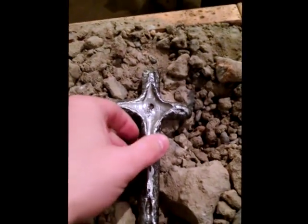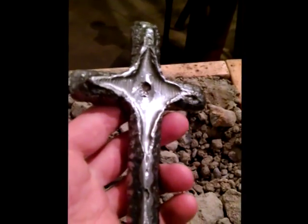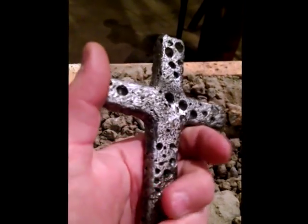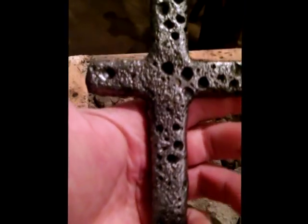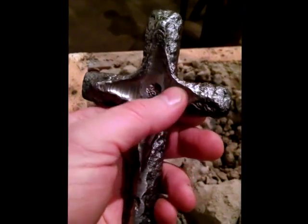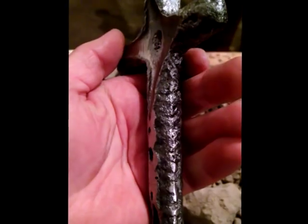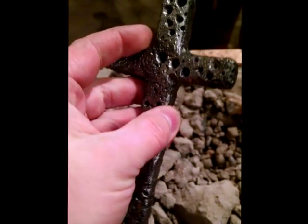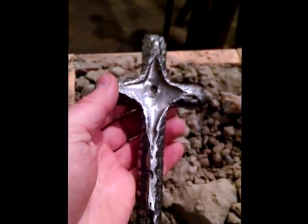Here's the finished product — we have about a one pound cross. Very interesting. We have lots of pitting and texturing on the surface, both with gas voids but also some smooth areas in the front. Part of that is that the liquid iron and the aluminum oxide are all mixed together, and the iron is trying to rush to the bottom from weight while the aluminum oxide is trying to float to the surface.